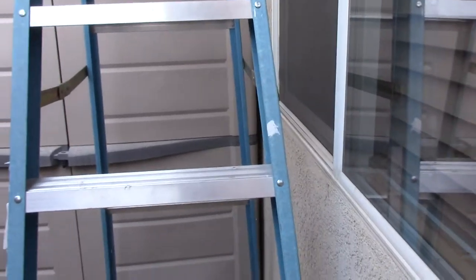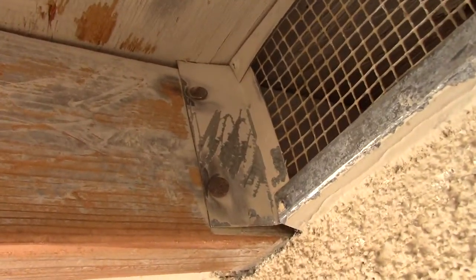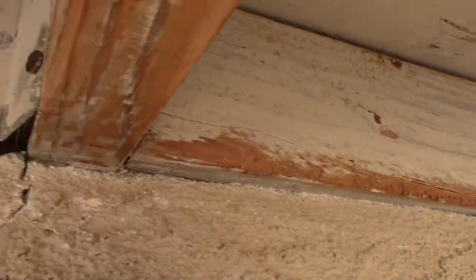Let me show you what it takes to prepare the eaves. You want to make sure you're comparing apples to apples — if you want to pay for a spray painter just to colorize your house that's one thing, but you want it to last so it requires a fair amount of preparation. As you can see, we filed off the nail heads to get all the rust, using a rotary tool on a drill. The wood has been fairly well scraped and is ready for primer.